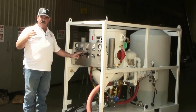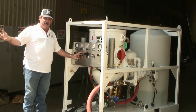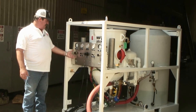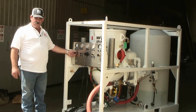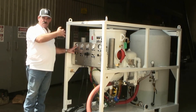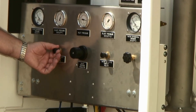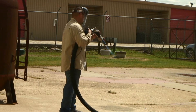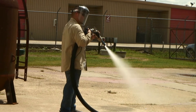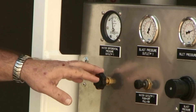At this point, I'm ready to call for water to my nozzle. I'm going to have one operator at a time start their nozzle, then give them water by turning this valve on and presetting the pressure. For this video, I'm going to run 10 psi differential from water over air. Operator on — I will call for water, and it will take a couple of seconds for the water to get to the nozzle, as the entire length of hose has to get wet. I'll set my water pressure for this video at around 10.